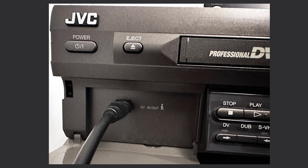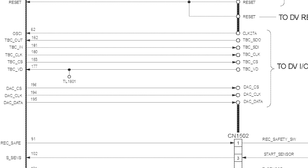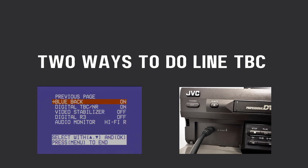The final question is: does the DV digitization circuitry act as its own TBC? Looking at the service manual, there are a lot of references to TBC in the section about the DV in-out stuff. I'm not an expert in these diagrams — I basically want to crawl into a corner and cry when I look at them — but it seems like the DV circuitry has TBC functions in it that fix the jitter too. So I guess that means you can turn off the TBC-NR feature in the menu when outputting via DV, because any jitter, flagging, or waving should be fixed as the signal passes through the DV in-out port.